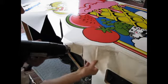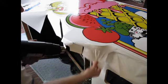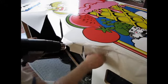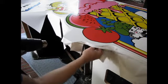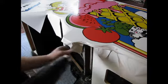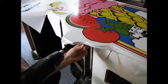When pulling the vinyl and sticking it to the edge, take any excess and stick it to the cabinet where it's out of the way. It takes time to get it just right, and some angles might be harder than others. So go slow and try to keep any wrinkles below the T-molding cut.